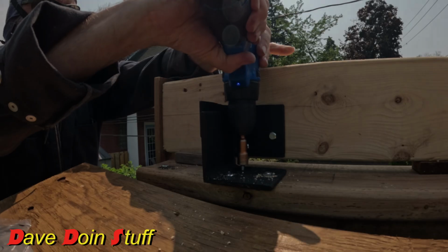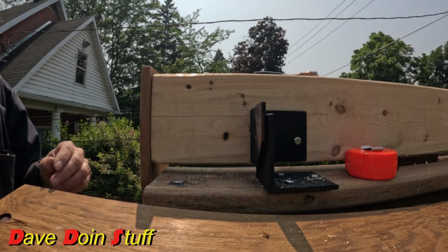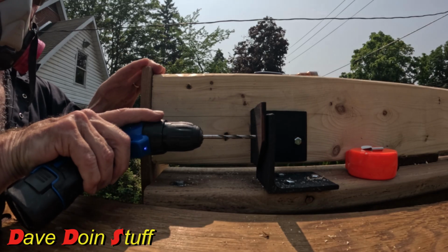All that's missing is the pin for it to rotate on, and to install that, I measured an arbitrary distance off of the shed roof and off of the roof section, and drilled a hole. Once the hole was drilled, I put in the bolt. Those hinges are done, both sides the same.